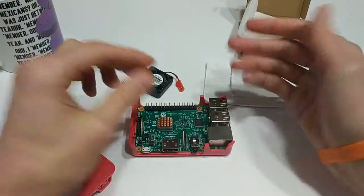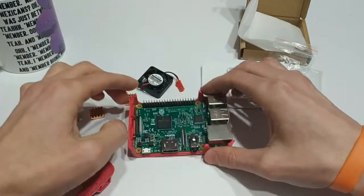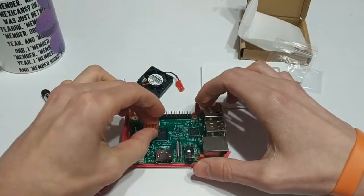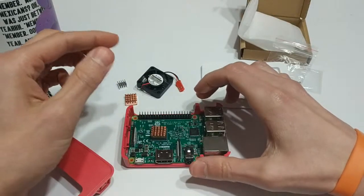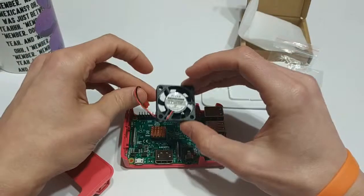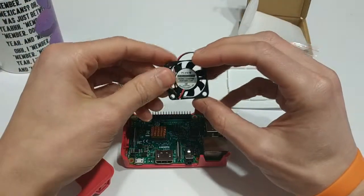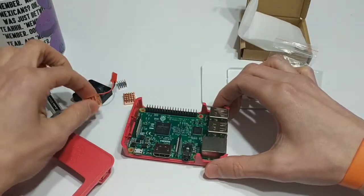In a normal PC you usually have a couple of different things that affix everything into place because sometimes your motherboard is on the side or whatever. But with the Raspberry Pi it just kind of sits there, and it should stick down just enough. All said and done, I'll have the heat sink there, I'll have the fan going underneath, I'll have the sides open — and we should get enough airflow and passive cooling to reduce the temperature a couple of degrees.